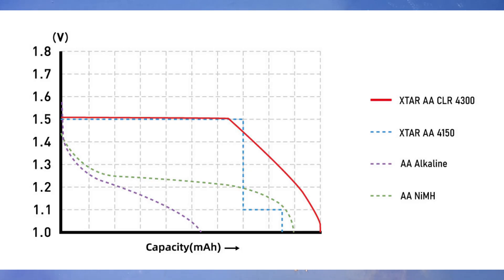The battery voltage drops suddenly to 1.1V when the capacity drops to roughly 20%. This gives the battery gauge circuitry found on some electronics a chance to warn users that the battery is about to run out. But the change is actually quite sudden.